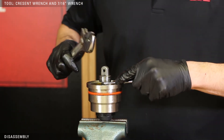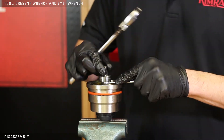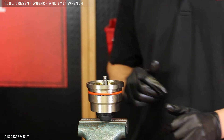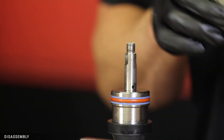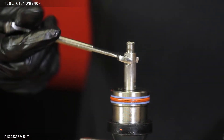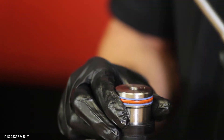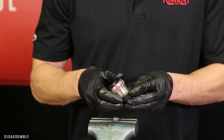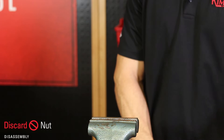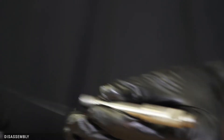Use needle-nose pliers to remove a snap ring, slide the link pin out, and disconnect the trunnion hub from the nut. Use a crescent wrench to loosen the nut and a 7/16ths wrench on the flats to keep the stem from spinning. With the nut off, pull the cylinder out. Rotate the stem using the 7/16ths wrench so that the piston assembly can be completely disassembled. Lift the piston, seat, and ratio plug off the vise. Remove the nut from the vise and discard. Use compressed air to clear any debris that may be in the communication hole on the stem.